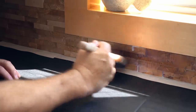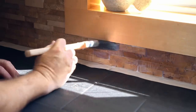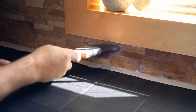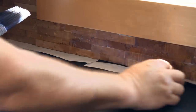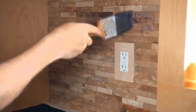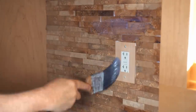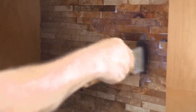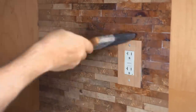The first step is to slip a piece of paper along the bottom so that I'm not getting any finish down on the countertop. It's very important to pull that paper out as quickly as you can after finishing the blocks so that it doesn't get glued in place. I know that for the very obvious reason that I actually did it — I left the paper in and then had to cut it out with a razor blade.